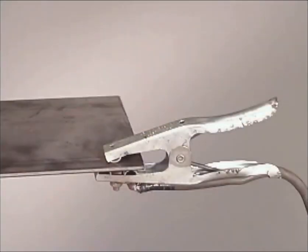That is about all there is to the fundamentals of gas metal arc welding. Have a good, clean ground. Use a short electrode stick out for a hot start. Maintain 1/4 to 3/8 inch wire extension for consistent penetration. Back the gun away a little to cool the puddle for filling gaps. Push the weld to limit penetration and to see where you are going. Pull the weld for more weld buildup. Set the voltage and wire speed high enough for good filler metal fusion and tune the settings for a stable metal transfer. Move slow enough to allow the puddle to flow out and tie in on the sides, but fast enough to keep the wire on the leading edge of the puddle and avoid excessive weld buildup.